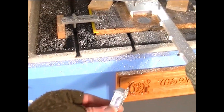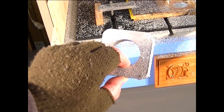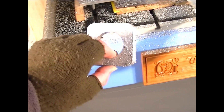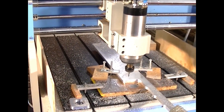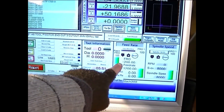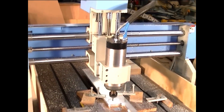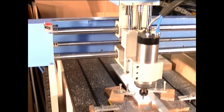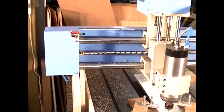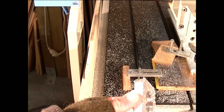That's 12mm of aluminium and it's about 70mm square. The feed rate from memory was 10mm a second — you can see what 10mm a second looks like running a CNC router. The depth of cut was 0.5mm each time, so it took 24 cuts to do the 12mm. You can see that's fresh off the machine — it is near perfect, straight off the machine.